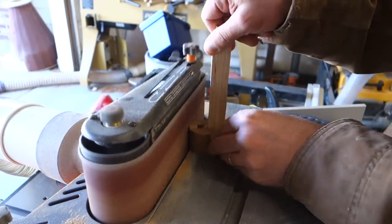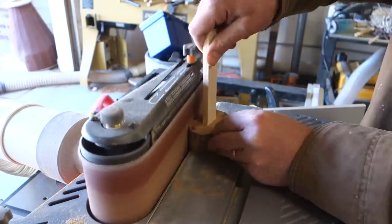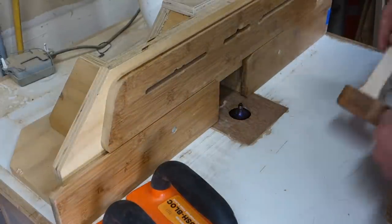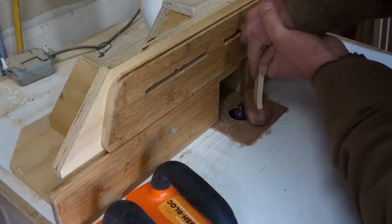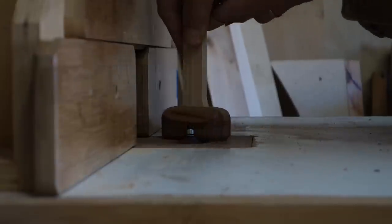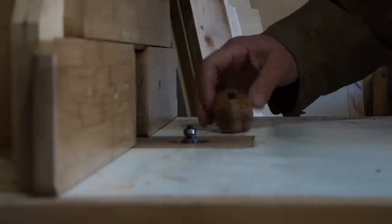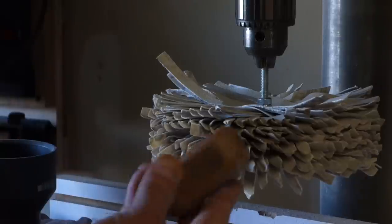Shaping the guard — I cut a little piece of wood that really helped to manipulate it, since those smooth edges would be hard to hold on to. This worked not only for sanding and getting the curves correct, but also made it much safer to take it to the router table and rout a nice chamfer on both ends. It would be really unsafe to try and hold the guard by hand at the router table. Having that slot and that little piece of wood made this viable. I did get a little tear-out when routing, but they turned out really nice.